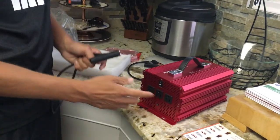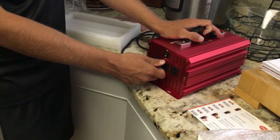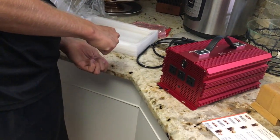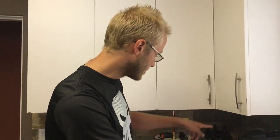We're probably not actually going to use these built-in plug-ins. We're only going to put one plug-in into here, like an extension cord, and then we're going to cut the end off — that gives us the wires out of the extension cord, which we're going to run into our panel box, our electrical panel. And then that's going to run all the plug-ins and lights throughout the camper.